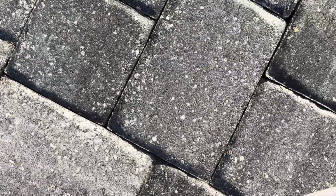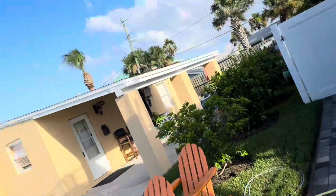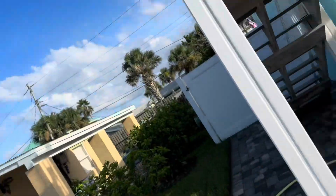And what I want you guys to pay attention to is that when you do a paver driveway, you don't have to turbo tip all the time. If you're going to seal and sand, I highly recommend turbo tipping, along with your surface cleaner. But we had thought that we were going to do some turbo tipping because the center area, you can see where it puddles up.